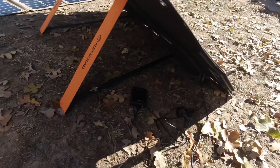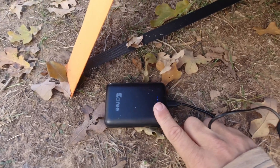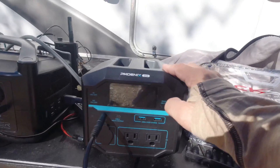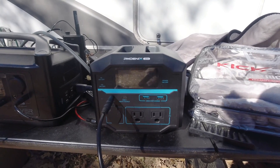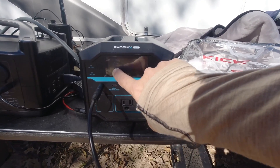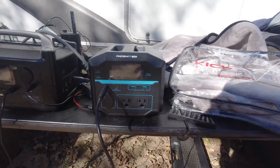Inside the back here I've got my battery bank power pack from the heated vest I did a video about a couple weeks ago, plugged in over here. And we've got it coming into the Renogy pack right now, reading at 42 watts coming in — about three and a half amps. The Renogy is at 99% right now and it's saying 15 minutes to 100%, so it may have throttled the input down.